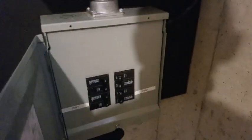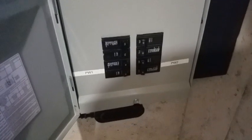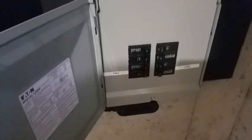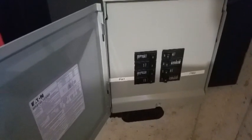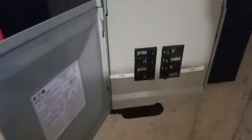Right here is one of the sub panels they installed. In this sub panel are the breakers for the actual batteries — Powerwall 1 and Powerwall 2 — the breaker for my backed-up panel, which is the panel that will receive power if I lose power to the grid, as well as my solar panel, which I'll show you in a second.